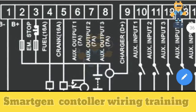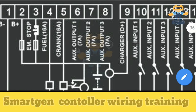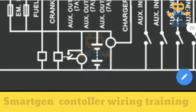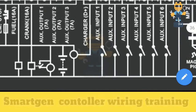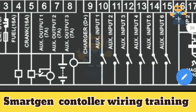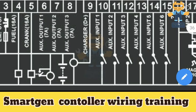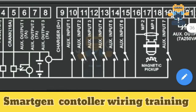Terminals four and five are two digital outputs — they give continuous command signals. The crank supply will activate for every three to five seconds, for three attempts. Contact ratings are 16 amps each. We will use an external relay for fuel and crank using this symbol shown. Terminals six, seven and eight are auxiliary outputs rated 7 amps each. These can serve as backup for fuel or crank, or for any additional output needs — three extra digital outputs usable with external slave relays.